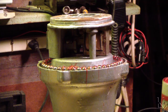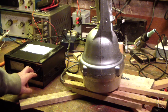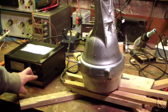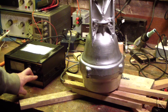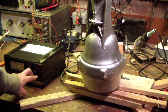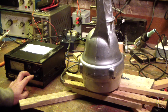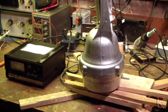I'm ready to clean the top race and put the bell back on. We've got it all back together. Not only does it sound smoother, but I think it's actually turning faster. It's still noisy, but it's a big engine with big metal gears — it's nowhere near as noisy as it was and it's much smoother. Now listen — hear how nice and even that is? And the other limit switch, right about there. Okay, well that's it. That's how you lubricate a Ham-4 rotor. Thanks for watching.